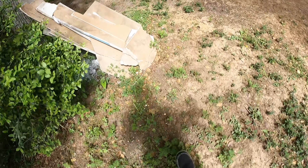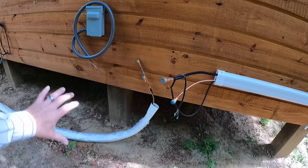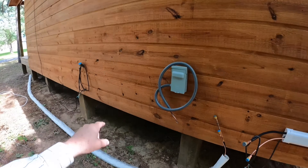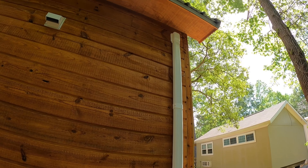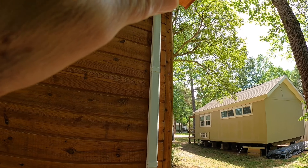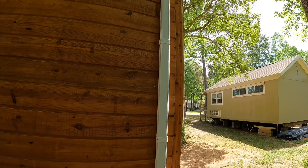I have one of my units already installed, so let me show you what it looks like. Seems to be a great kit — it was pretty easy to put together. There's the end of the lines; the condenser unit is going to be right here. I'm bringing another line down and over to it for my living room; this one is for the bedroom. It runs up and through the wall, with a nice piece at the top to cover your access hole. I filled it with spray foam and screwed the cover on.